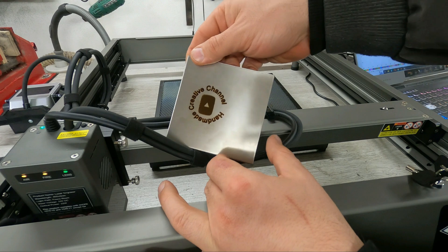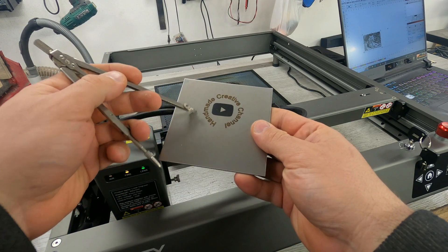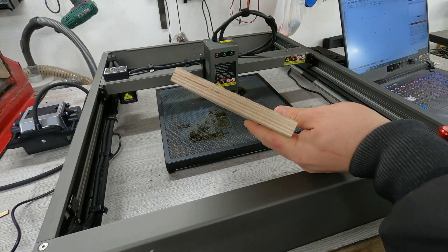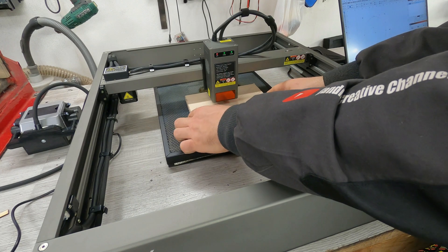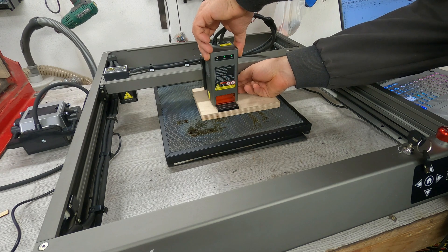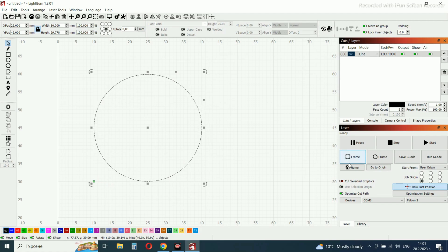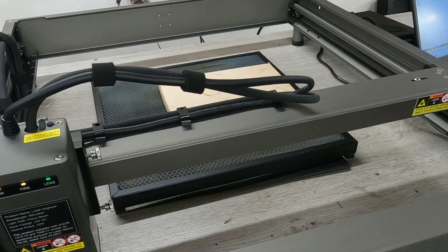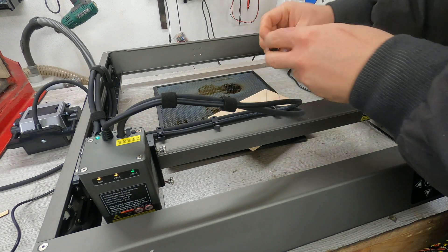The result is fairly good and deep engraving on the metal. This laser is definitely worth it. You can hear the sound from the engraved area. Next, I will cut a circle in a piece of plywood with a thickness of 15mm, setting the air-assisted laser to 100% and focusing the laser with the attachment. Great cutting on 15mm plywood — this Creality Falcon 2 laser is awesome. You can make all kinds of things out of thick wooden materials.